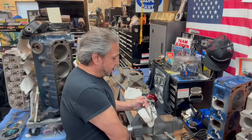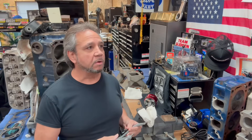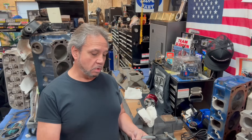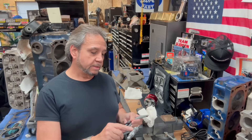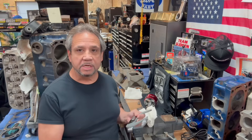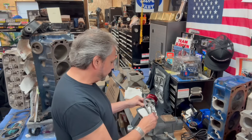On a Zoom meeting on Tuesdays they were talking about piston-to-bore clearance — the more cylinder pressure and heat, the more clearance you need, especially for blown, pro stock, or nitrous applications. Pro stocks apparently run 10 to 12 thousandths of clearance. Looking at this measurement, it looks like .09, so 4.009... actually counting the lines it's 4.0850. I'll write that down — 4.0850. Now let's set the bore gauge to that and measure the clearance.